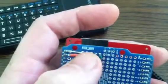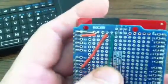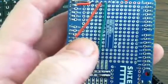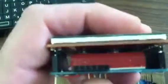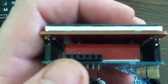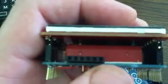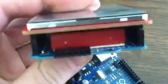So I wanted the analog, and this gives me 2 inputs, or outputs as it were, and I picked up ground from this rail and I picked up 5 volts off of this pin. So basically the pin out here would be A5, A4, nothing, 5 volts, ground, and nothing, which you could bring the 2 digitals into those 2 holes. I just didn't need them at this point.